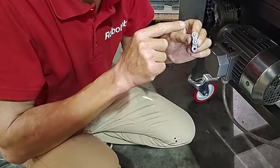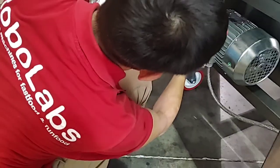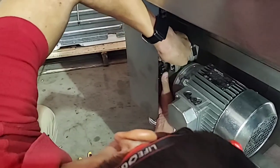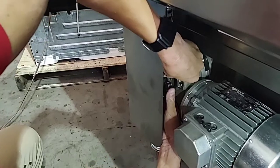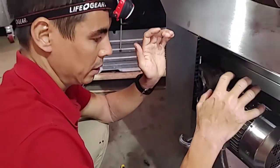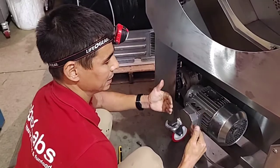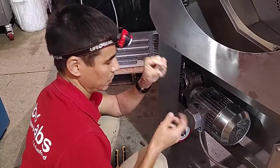So we remove two basic elements. Now our chain becomes shorter and we are ready to connect it. And if right now we find that we don't have enough length of the chain — remember the plate where the engine and reductor are situated? — we can just easily lift it up a little bit, connect with the locker, and that's it.